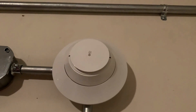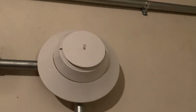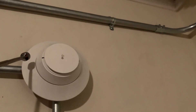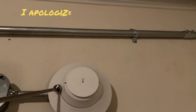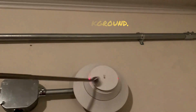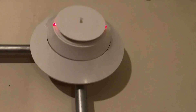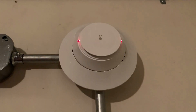It's now blinking, which means our heat detector is functioning. All that's left is to test it out. I have my magnet testing tool — we're going to hold the magnet up to the sensor and the LEDs will turn steady red. The voice evac is off because it's late at night so only the strobe is active. And you can see the LEDs on the detector have turned red.